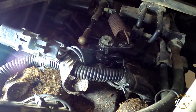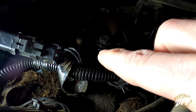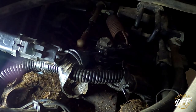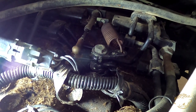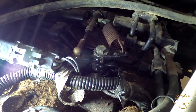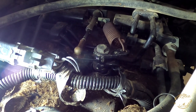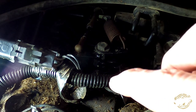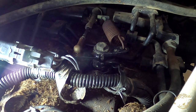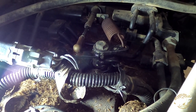We'll go to the back of the tractor here. Right here is where the end of the clutch cable comes in, and it pivots on a mechanism here — you can see a spring right there as well. This is where the clutch cable comes and pivots. I had been lubricating the cable and the pivot point here as well, over and over, using some PB Blaster, to see if that connection where that bolt is and where everything pivots was getting some rust on it. I did that all summer and unfortunately it didn't solve the problem.